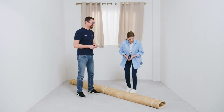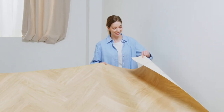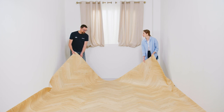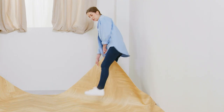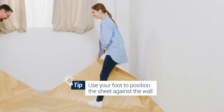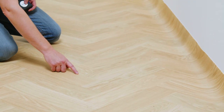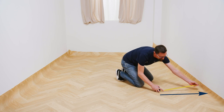So let's unroll it. The technique here is very simple — you put one of your legs on the material like this, and then very slowly you push with your foot. A small tip: if you want better aesthetics in your room, I highly recommend installing the wooden pattern in the direction of the incoming light. So if the window is behind me, it's better to unroll your product in this direction. And especially for a herringbone design, make sure that your sheet is really parallel to the wall. For this, you will measure the top of one herringbone to the wall at the beginning and at the end of the room.